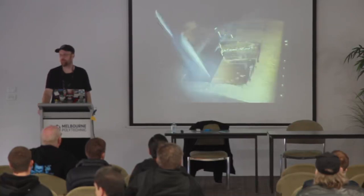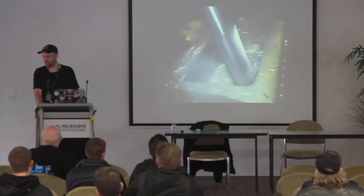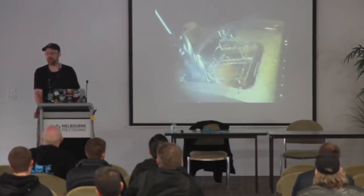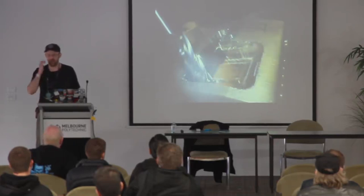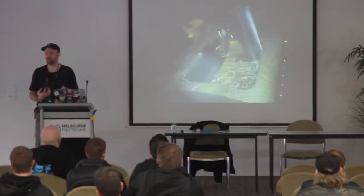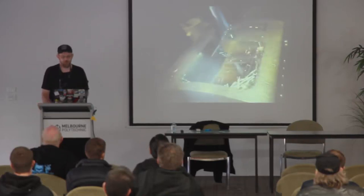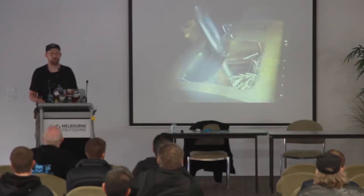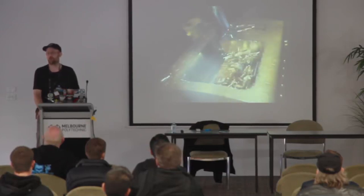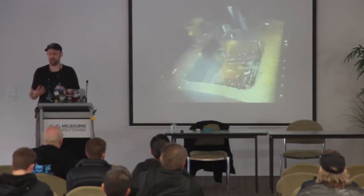Is there any lock you just won't go back to? So far that's my feeling on the Abloy Disc Lock Pro series. I've done a bunch of them — they look good — but cutting the plug around the outside and disassembling it, sometimes the plate will fall through and it just won't hold together anymore. I would probably do one again if someone asks nicely. I'll cut any lock — I'll give it a shot. I like risk. Sometimes I'll spend hours researching a lock before I even take it apart, going through patent drawings to understand the mechanism, just so I'm not wrecking it in the process.